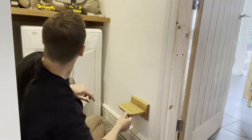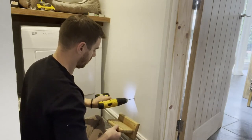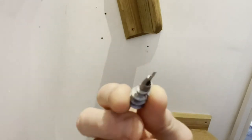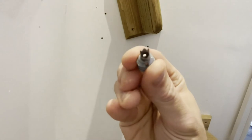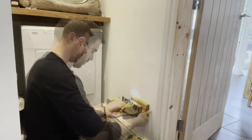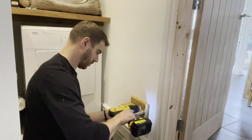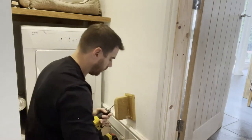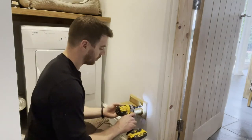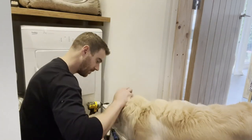Once they were ready I had to mount them to the wall. I eyeballed the positioning but as this was a stud wall and the weight wasn't going to be excessive I just mounted them wherever looked right. I drilled a pilot hole in the wall where I wanted my first screw to go and then screwed in one of these metal drywall plugs — they hold really well and screw in very easily. I recommend drilling a hole to start them off though as the tips can break if they're subjected to too much force. Once I had the first plug in place I drove in a screw and used a level to get it flat. Then I used a thin drill bit through the holes I drilled into the backer plate to mark out where the other three holes needed to be. Once I'd done that I pre-drilled with a wider drill bit and screwed in the drywall plugs as before, then it was simply a case of driving the other screws in and the first one was done. I passed the inspection from Molly and then it was on to the second one which was done in exactly the same way.